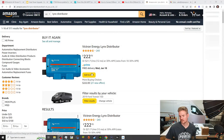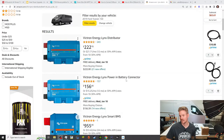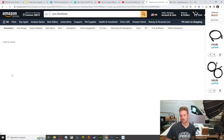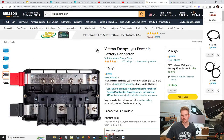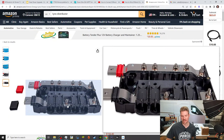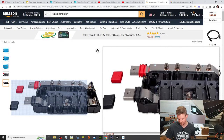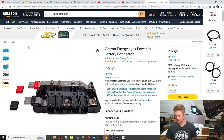So we're using the Lynx distributor. And I love the Lynx distributor. Not affiliated or sponsored or anything like that, but I love them because it's just such a compact way to manage your incoming power and then fusing that properly. So we would have it come into here, fused and then distributed.